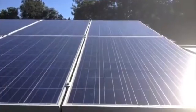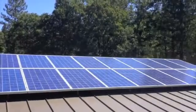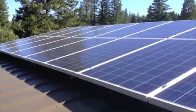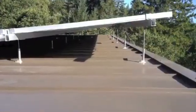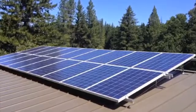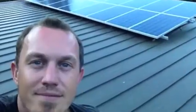The panels have been installed: 18 panels at 230 watts each for a total of 4.1 kilowatts. These have been wired in strings of three panels each, six strings total, and they've been tilted at 15 degrees facing south-southwest. This is the completed mounting and grounding to the rail, and I'm very happy about how it looks.